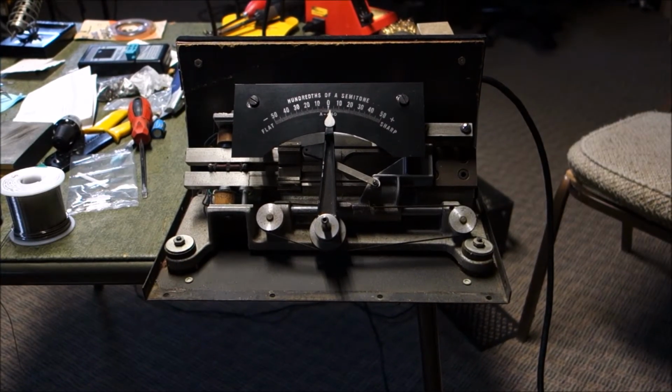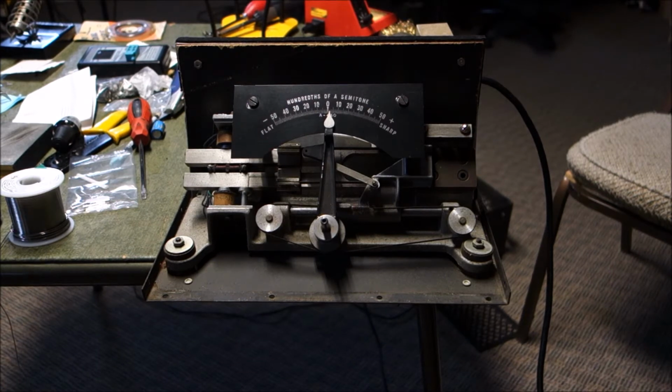Okay, in replacing the very tired 5U4 rectifier with a moderately tired 5U4 rectifier, the device was at least able to start on its own. It is still under voltaging and choking. There is a little bit of a drive adjust mech on the side there. But we really don't have super strong tubes, and I'm fairly certain that our not so smooth drive tubes are not helping us. We have very old capacitors, very old tubes, and a lot of dirt. So to really get this running properly, we probably are going to be doing as much surgery as I did on my S6T5 cap job and replacing all tubes that were tired. All right.